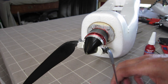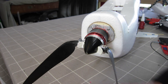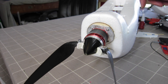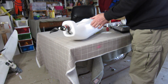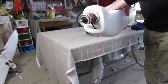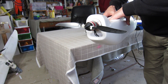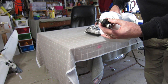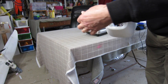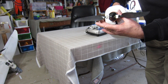Let's give it a run up. I tried it just before — just check out how much current it's drawing. It pretty quickly gets up to 40 amps, and full bore it'll be about 50 amps, so that's drawing a lot of current. That is nice — very smooth indeed. I'm very happy about that. Didn't have to do any balancing at all. I even tried a little bit of dynamic balancing with bits of tape on the props, but everything I did just made it worse, so I'll leave it as it is.